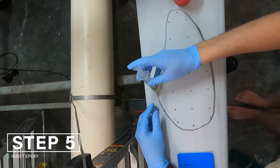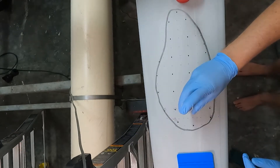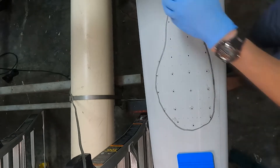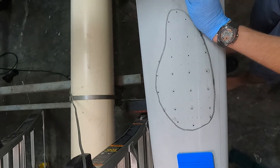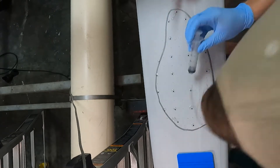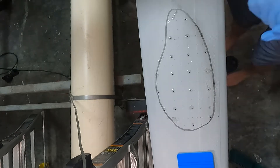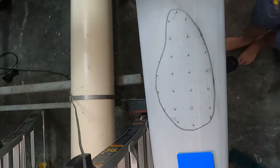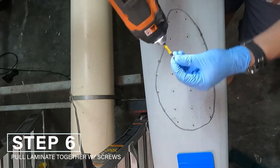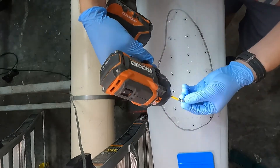Future Jacob here — I just want to say this was one of the worst repairs I did, but it's probably the best documented since it was the first. As long as you follow the tips in the video — drilling out clearance holes so the fasteners don't push the laminate apart, and making sure your epoxy is thickened to help fill the voids — your repair should be successful, as all of my future repairs were, and they were very large. You'll see that in a future video.